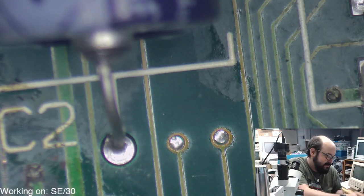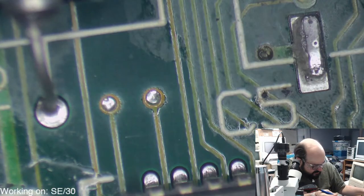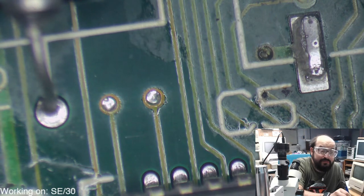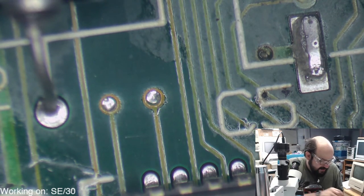We're gonna plug in the problematic tip, because that's the one I'm gonna use first for these axials. Let's hope this doesn't get red hot, because I don't want it blowing up. Safety first. Oh my goodness. Alright, so we're gonna turn this on. Okay, there it is. So it's set to 400. We're driving 25 volts. That's normal. Beep! Alright, that means it's at its temperature. Should be happy. No red yet. We're gonna put that where we could see it. Keep our eye on it.